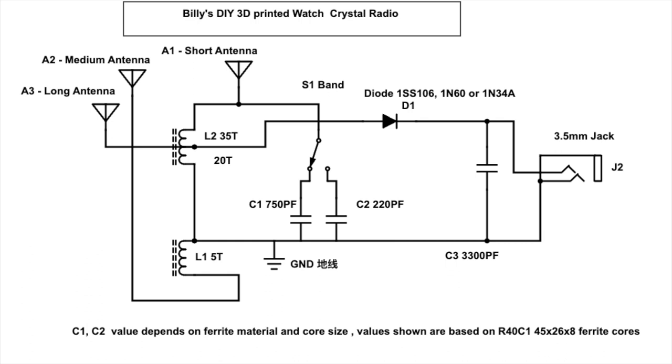In the resonance circuit we have two coils and two capacitors. They form the resonance circuit, because the variable inductance of my ferrite ring and coil combination cannot meet the nine-times variable inductance value from minimum to maximum. Because of that it can't tune the entire AM frequency band from 500 kHz up to 1700 kHz, so I fix it using two different fixed capacitors: C1 at 750 pF for the lower AM band, and C2 at 220 pF for the higher AM band.